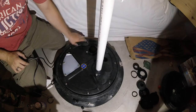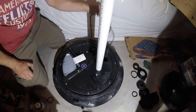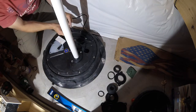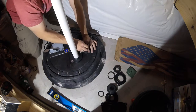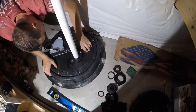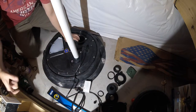I've got all the cover bolts on and it's really sturdy. Next thing I'm going to do is get the grommet on for the electrical. You run your cord through and it's supposed to be a snug fit, so you've got to fight with it a little bit — that's to be expected. Make sure you don't hang the pump by the cord. Get a little bit of the cord through there and then shove it back down, making sure the pump isn't supported by the cord. That works nice. Let's put the extra cord off to the side and when we're done we'll plug it in.